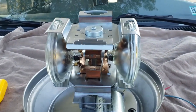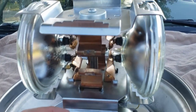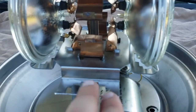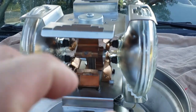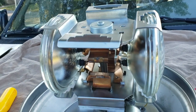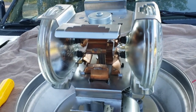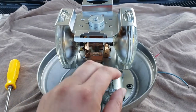We really don't like this design. But if you look at it, this gives you a good shot of what this thing looks like on the inside. These bulbs are held in place by the tension between the top rung and the bottom. The clips actually lock into place on the bottom and also on the top, and then this presses down and keeps the bulbs in place. What ends up happening is that when you release the tension on this, the bulbs start to fly out, and you have to be careful. I'm not going to take the bulbs out while I'm on camera because I can't do this with one hand — we're going to end up launching everything.